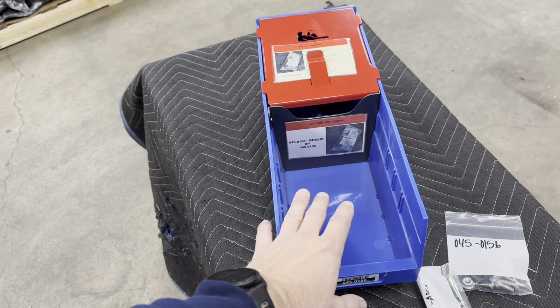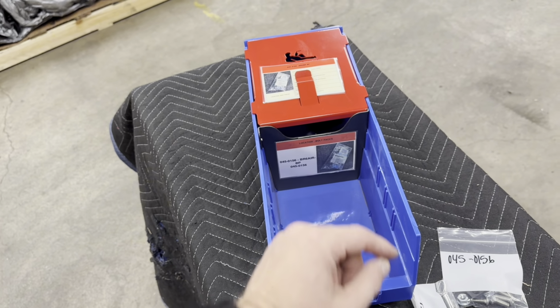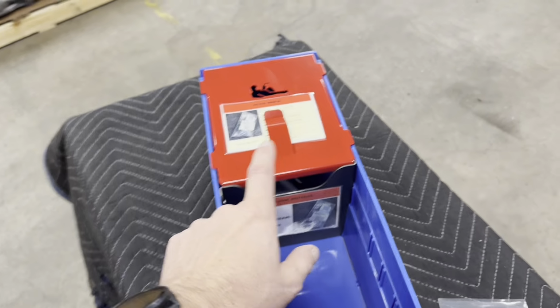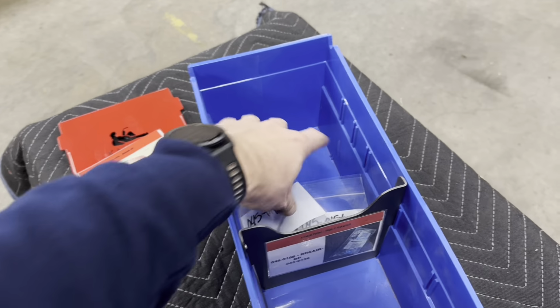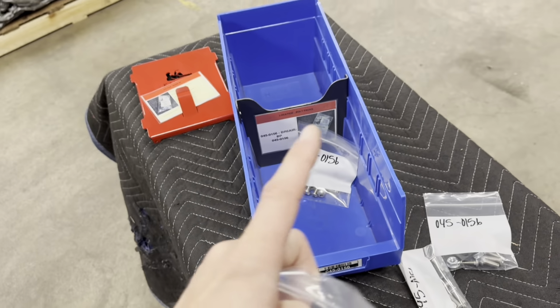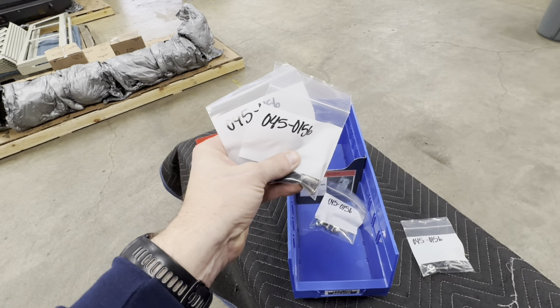Now we're leaving this bin empty, but that's okay. And we don't have to pull the Kanban card yet because we still have inventory. So now the third person comes over here to package this. At that point, they have to go underneath the hatch. So they pull this off. They then once again turn the Kanban card back into the station. They pull the inventory forward, grab what they need, and we still have 1 here. So now we've reproduced 2 based on the Kanban card.